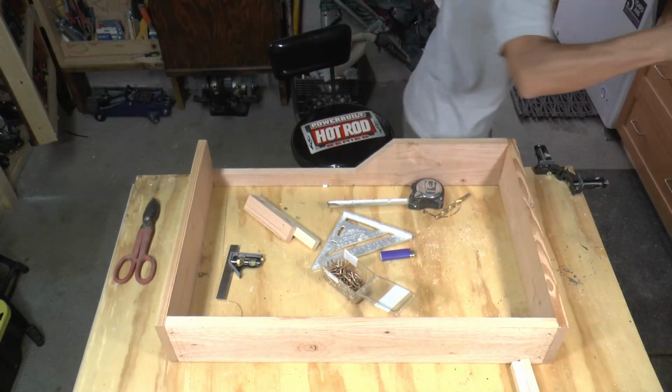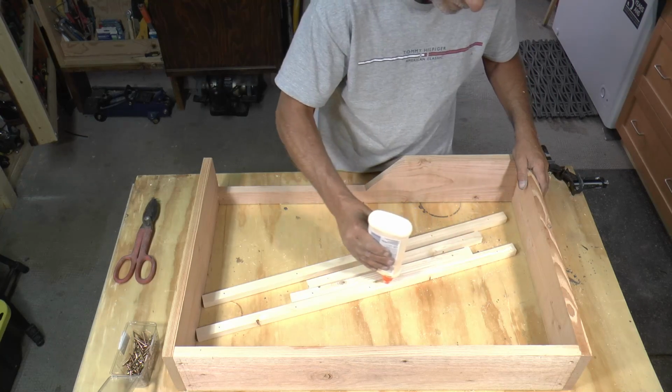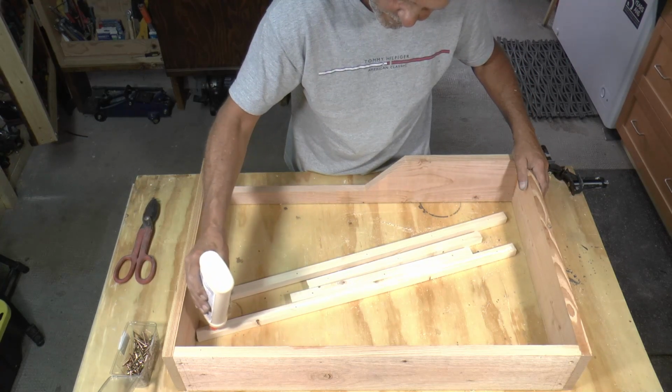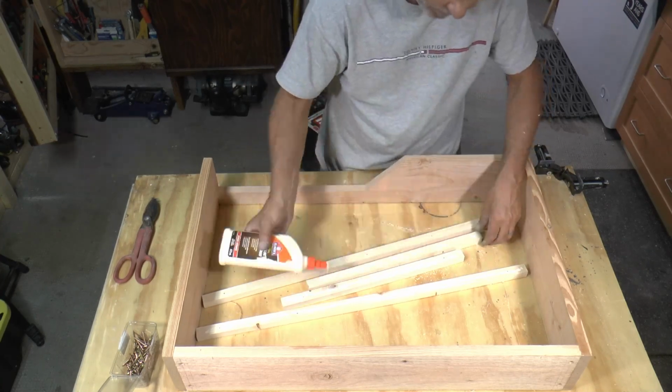Now I'll fasten the base support cleats to the bottom edge of the larger base box. These cleats are what will hold the base slats in place and ultimately keep your dog cooler by creating an airspace between the bed and the floor.